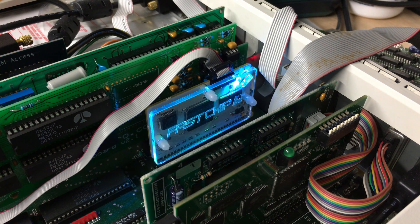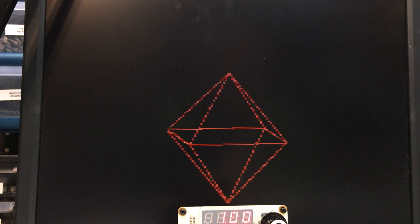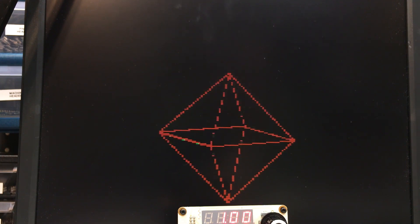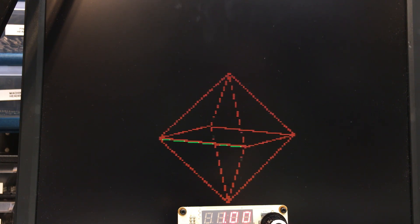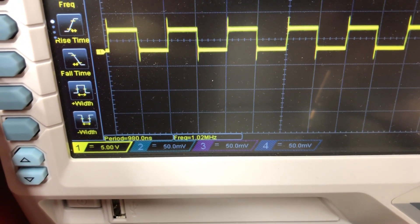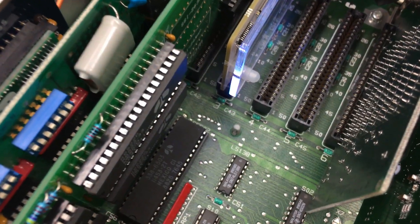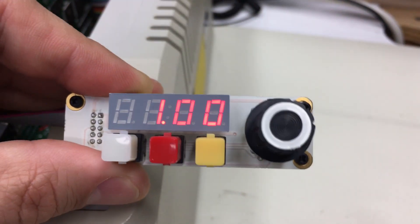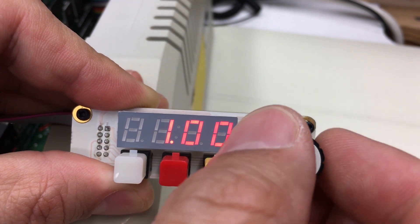What I find most amazing is that the FastChip, when set by the dial at 1 MHz, is almost always slightly slower than the native Apple IIe by about 2.5%. I assumed this was because its 1 MHz clock was exactly 1 MHz — slightly slower than the Apple IIe native clock. But a quick test with an endless machine language loop in RAM, with the thing hooked up to my oscilloscope here, confirmed this to be incorrect. So it seems that even at 1 MHz, FastChip is still doing some internal logic when accessing different parts of the memory map that causes a slight performance reduction. The quick way around that, though, is to simply turn FastChip off by pressing the far left button, or cranking up the dial one notch.